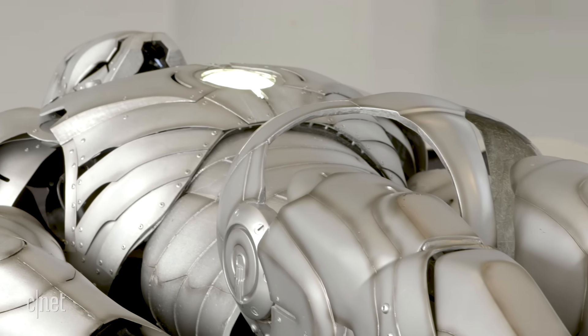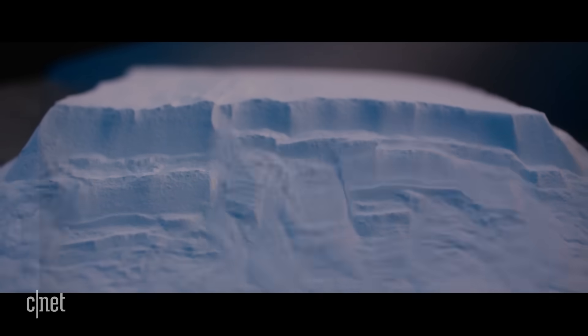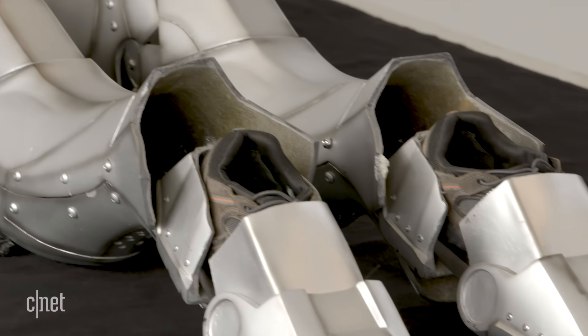One of the requirements we were given was to make the parts as thin as possible because we were trying to minimize weight. We use a laser beam to melt metal powder. The metal powder is about 40 microns in diameter — about half the width of a human hair. We spread a layer of powder across the build platform, the laser selectively scans and melts this powder, and then it builds up layer per layer based on the geometry. Once it's done, you remove the powder and there's your part.